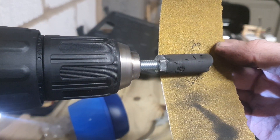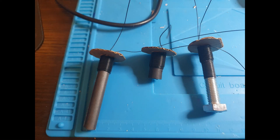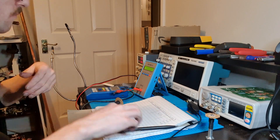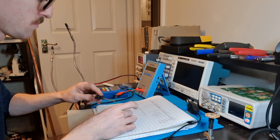Since 80% seems to more or less be the upper limit of how pure I can make these ferrite parts, at least for now, I figured I would take one of those globs and machine it down into a test piece to compare it to regular ferrite. After reshaping the chunk, I got a similarly sized piece of real ferrite as well as a steel bolt, and wrapped 50 turns of copper wire around each one. I used an LC meter to measure each one's inductance and put two amps of DC current through each one to measure the magnetic field with my Tesla meter. I also did this with 50 turns of copper wire with no core, just to see the inductance of that one as well.